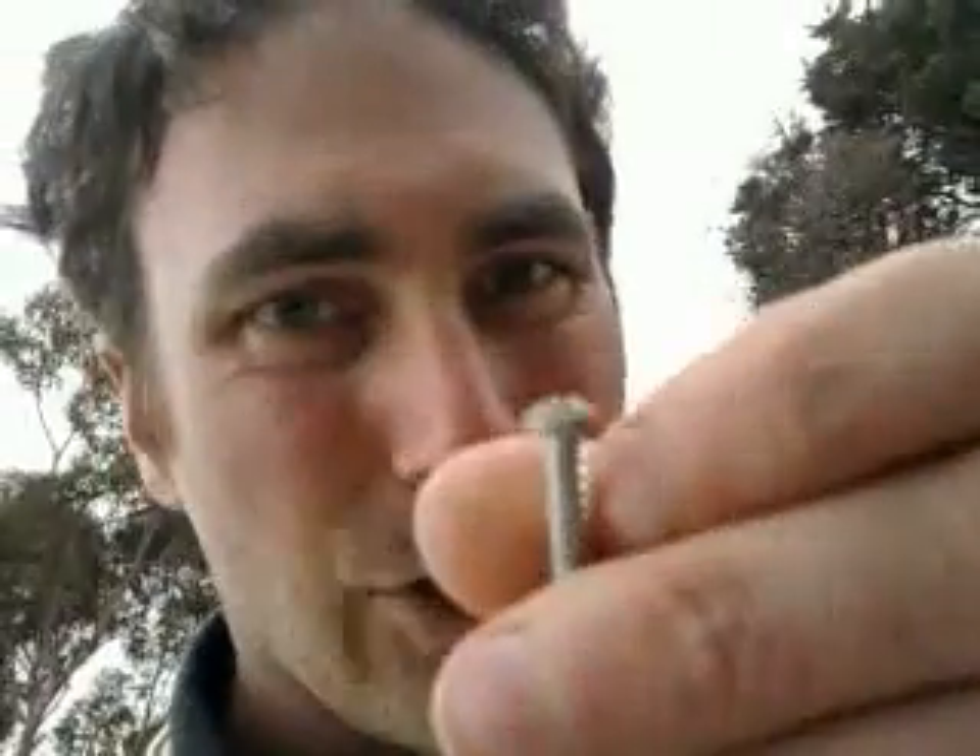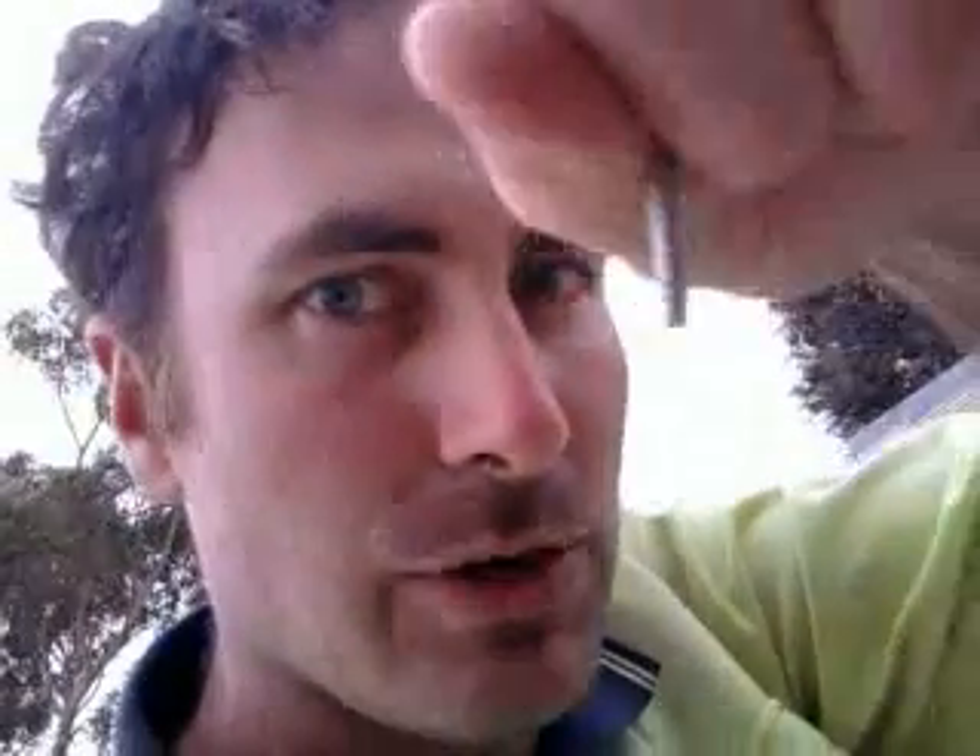The screws can start jumping and if you strip one out you're going to be in real trouble. Here's how you get past it though - little known fact: you get side cutters used for cutting wires and electronics, and you basically grab either side of the screw head. Come in from above with your side cutters, grab them and turn. Keep trying to spin your side cutters, open them up and go back for a second chomp. That's the way to get those out if all hell breaks loose. Have a good go at cleaning those screws before you start.